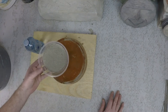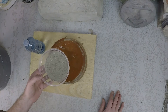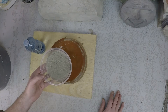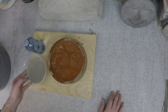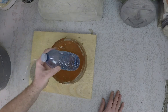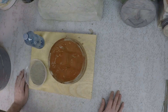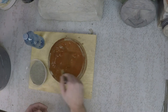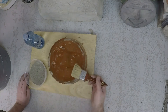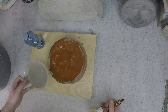What we've got here is just a little bit of cement powder — the same stuff you're making your concrete or mortar out of anyway, except there's no sand or gravel mixed in. It's just the cement. We're going to add just a little bit of water to make a paste similar to cake batter or pretty warm butter, and then we're going to take a paintbrush and paste that inside our mold before we apply our mortar.